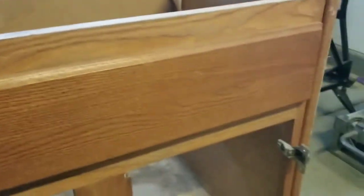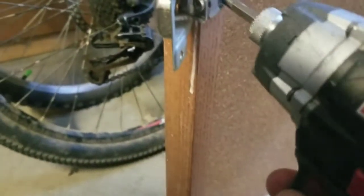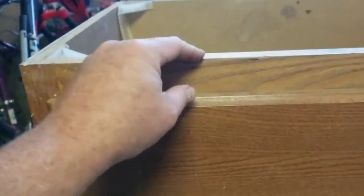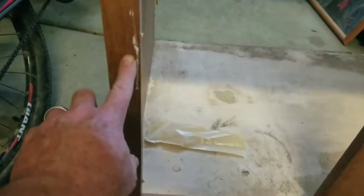I'm going to remove the other one and then we'll get cracking. I'm going to go ahead and remove these side pieces — they come off like that. So we've got all of our hardware off. Now I'm going to show you the setup I'm going to use to sand this down. This is just a fiber board — it's not even real wood — so really I'm just sanding to get all these scratches cleaned up and anything on the outside. Then I'll smooth it up, and I may go ahead and put some primer after.